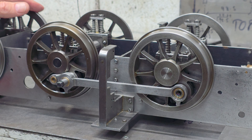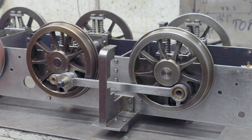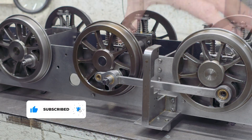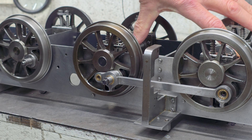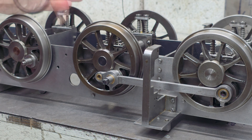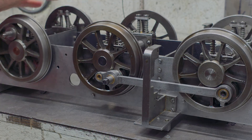Which, with the frames upside down of course, is this side facing the camera now. So I'll do a few checks offline to see if I can find out where the problem is occurring. I have checked the distance between axles - I did that before I machined the rods in the first place - and they are fairly consistent on both sides. So I don't have an axle at an angle. I'm pretty good in that respect.